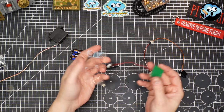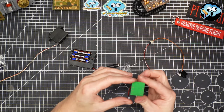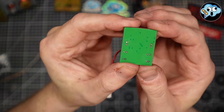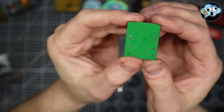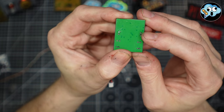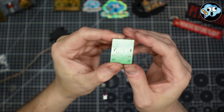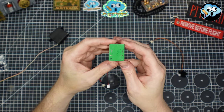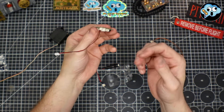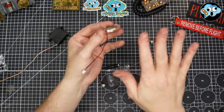And this is sort of like a safety box, just so you don't short things, short circuits. You can see there's a bunch of little contacts on the back of here. And you see how it's one, two. That one's a little close. Those are really close. It's very easy sometimes for there to be a manufacturing defect on a circuit board. And if something's not working right and you turn it on and something doesn't happen, turn it off right away.